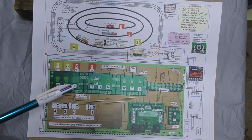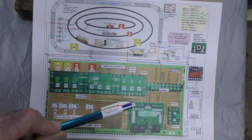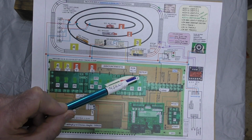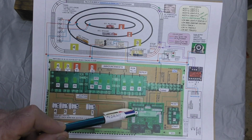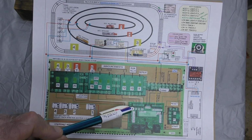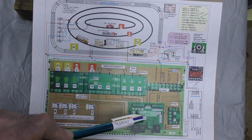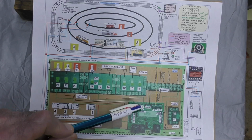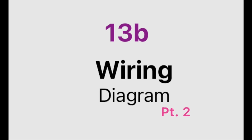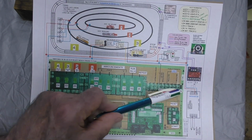And all these slide switches are numbered 9, 10, 12 up to 24. They're connected to inputs of the mini panel, the controller, and all they do when you push them to the on position, which happens to be down toward the camera, toward the controller, is ground an input, and that's how you direct this controller to do different things. You check like input, if input 9 is grounded, we go around and do it again. That's our repeat switch. And here we have a typical 8-position terminal block.